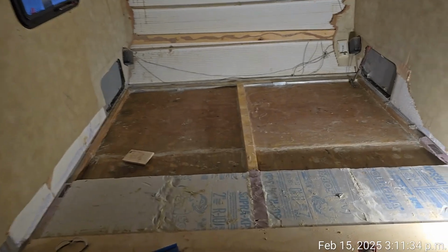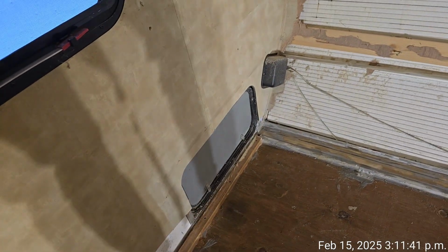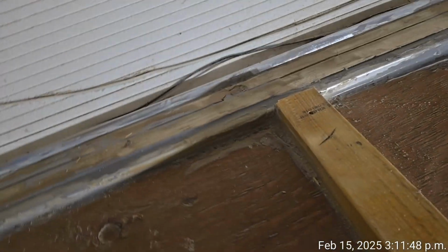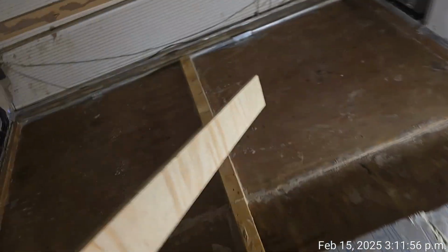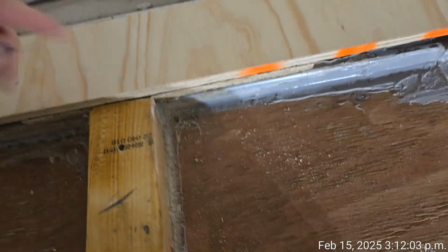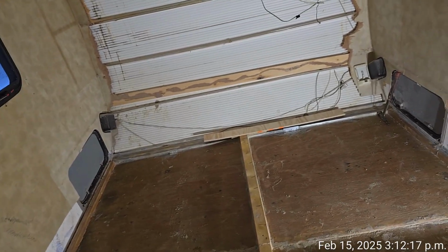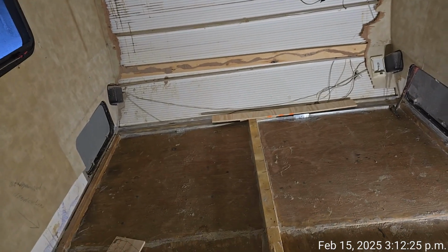So I got this all set up and ready for my floor. So I put my little kind of board on the outside as a nailer and to support it. And then the back here, because I'm a little low, I'm actually going to fur it up. I got 2 pieces of wood here. I'm going to sandwich them like this. So I'll get a piece of the MDF and then this, and the top of that equals 2 inches, so that my floor will slide right over the top. I'll get a bit more real estate. I didn't do it on the back like that because I didn't have a ledge per se. It was just different, but I might do it anyway in the back later. But that's what I'm going to do.